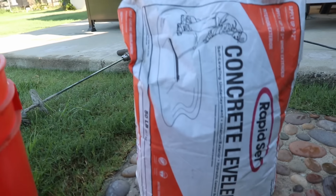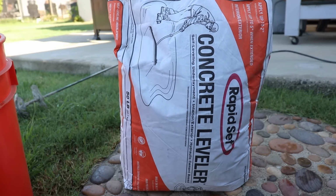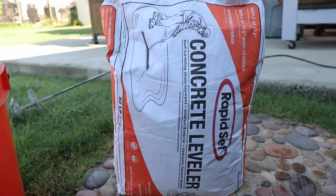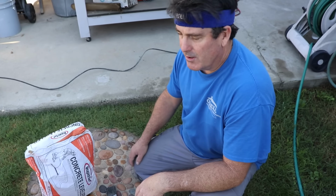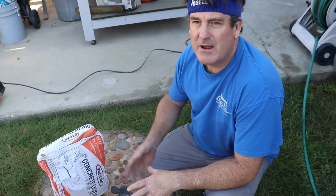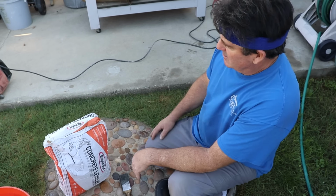Alright, we're getting ready to mix up the self-leveling for the base of our channel. This stuff is good all the way up to 5 inches thick. If you integrate some gravel into it, you can frame on this thing within 3 to 12 hours or start your flooring. But this is good interior or exterior, so that's what we're going with since we're exterior. Alright, let's do it.